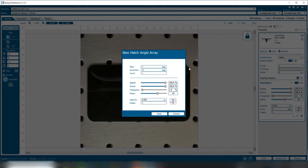In the job settings, all the presets are populated in the machine, but you can change these if your particular material looks better with a slight change to the laser parameter. We give lots of powerful control over the work you're doing at the laser through the job manager — a great tool for storing and manipulating jobs. With the job sent over to the laser, the last job sent always comes up on top of the list. If we want to verify the laser parameters, we click and hold on that job and then click on the arrow. This gives us all the laser parameters — speed, power, frequency, and waveform — listed for each hatching pattern, so you can verify the parameters are what you want.